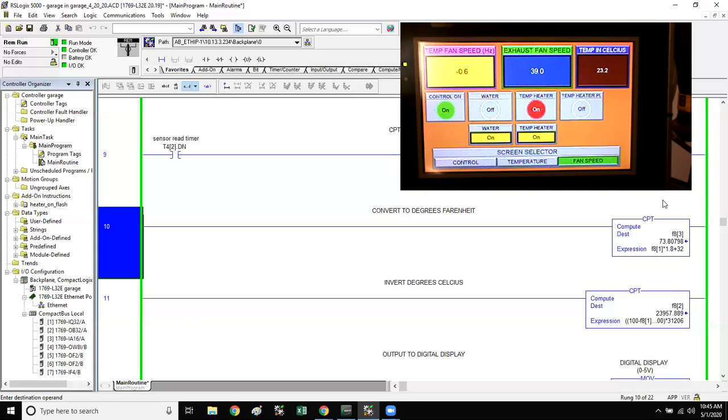It's not doing anything. Well, oh yeah, now it is. Should start climbing pretty quickly now because there's just a lag between the soldering iron heating up the thermocouple, and then there's a 10-second delay. Do we have the temperature heater just saying on or off instead of flashing on and off? The temperature heater on the output itself is the yellow square looking deal. Okay.